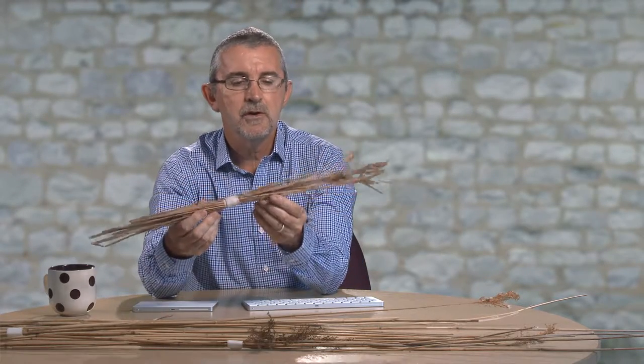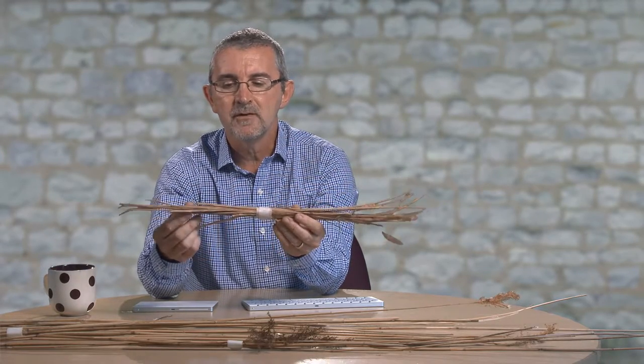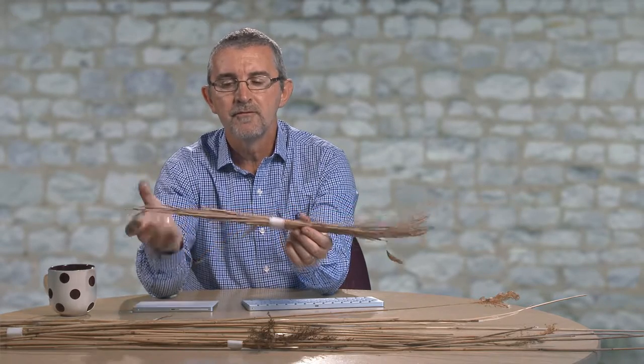And finally, we've got a genuine straw here — you can see the head of the straw. This, in comparison to the others, is probably the weakest of the lot: very thin-walled, very easily compressible and so forth. So where thatch is concerned, the important things to consider are where the material came from, whether it's a reed or a straw — the source and provenance of its origin is really important. The skill of the thatcher in compressing and putting it on nice and tightly so you get a very even bed — all of these things are really important.